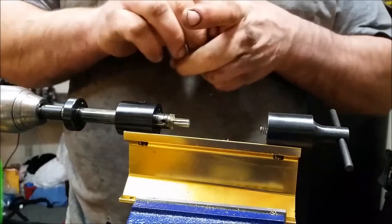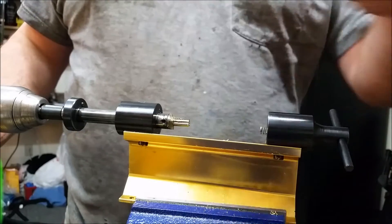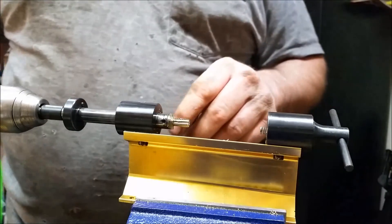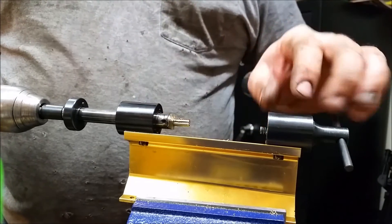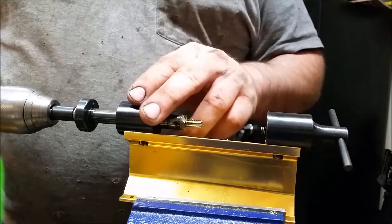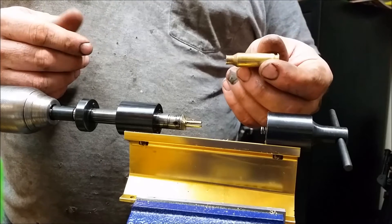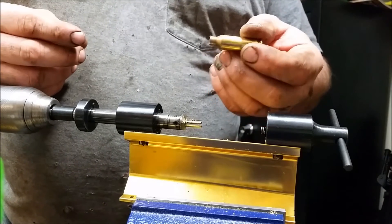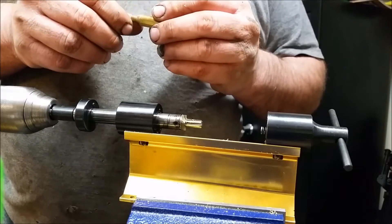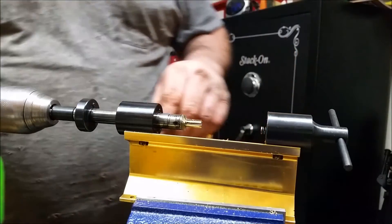You're going to need a Forrester lathe. You don't have to have the Forrester lathe if you don't want — if I was just doing neck turning, I may think about the Century 21 — but I like having my Forresters. I have two, so I can have them set up to do two different procedures at once: 257 reamer, Forrester lathe, trim. In this situation, when we're making the brass first and then sizing it down, we're going to want to leave these a little bit long. Trim to length is 1646 — I leave it at 1656. I'll do the final neck down and then come back and touch up the trim. Once I'm done forming, I'll do the final trim and they're ready to go.